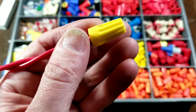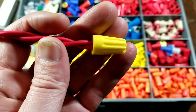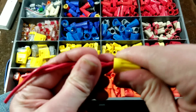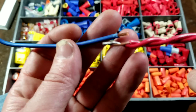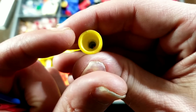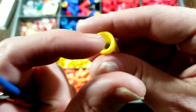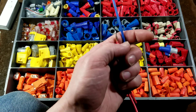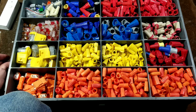Surprisingly, you do need somewhere between three-eighths and a half inch — about 10 to 12 millimeters — of stripped insulation, because the wires sink in deeply. The second issue I've run into is when there's just not enough wire stripped, such as on this blue piece of wire. What happens is the insulation starts getting caught up and bound in the bottom plastic ridge inside the wire nut, and that prevents the nut from actually being able to get all the way down and getting an appropriate bite on the wire.